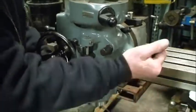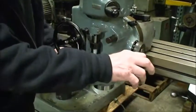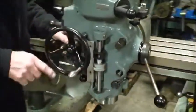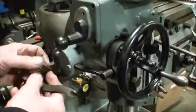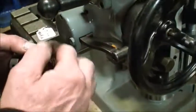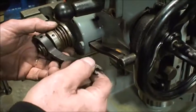Now, the amount of pressure on that clutch — it's a slip clutch — should be right there. If you don't have that pressure there, you can remove this cap, these two socket heads, and this unit right here will come right out. There is a set screw here that you loosen, and that will give you the amount of pressure you need on that slip clutch.